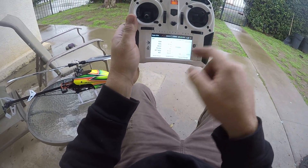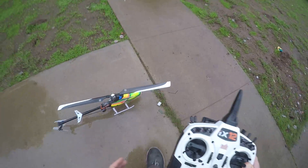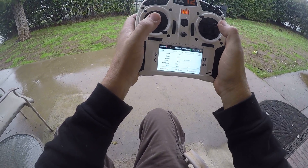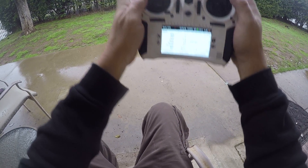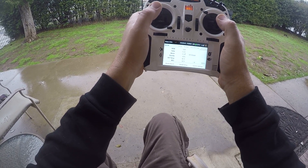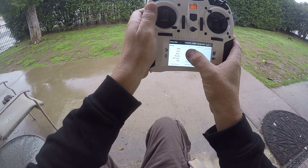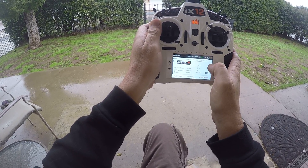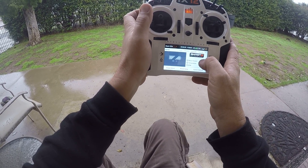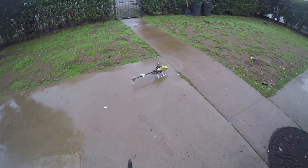You can see there is telemetry on this screen. I'm going to spool it up just so you can see it real fast, even though it's raining. You can see the telemetry and the RPM is working here. I'm sitting here on the ground — I'd say that's totally about 2000 RPM on the ground. There's 2200 RPM, 11.4 volts, motor amperage current. There's another screen here too — Smart ESC. I can set up a graph on that; there's motor RPM and the temperature. There's a lot you can do with this.